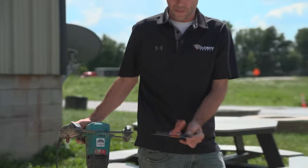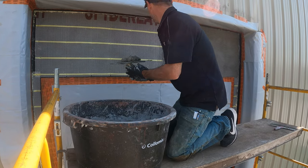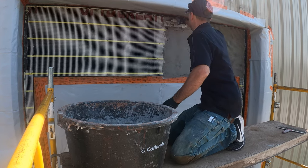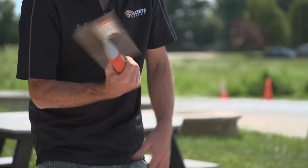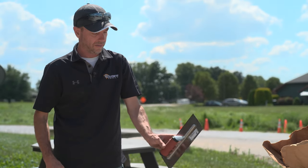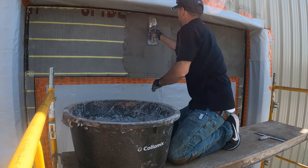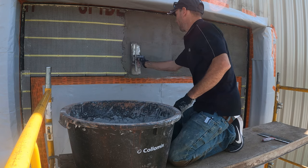As far as the rest of the tools, this little bucket scoop actually works great to get the material from our bucket and onto our trowel and apply it on the wall. Certainly, if we wanted to, we could use a mortar sprayer, spray this, and then just trowel it. I could use a notch trowel — I can smooth it with one side and use the teeth on the other to make my fingers. Although my preferred method is just to put it up with a normal finish trowel — a square edge always works best for me because I can get into corners.